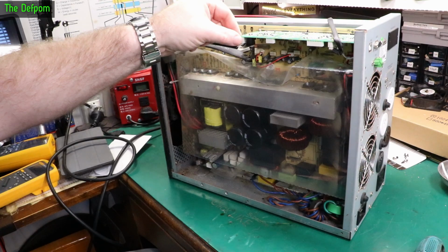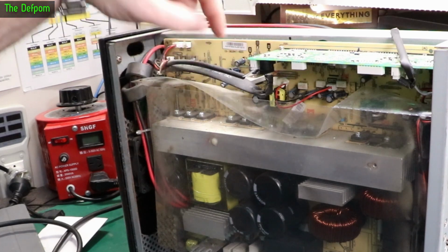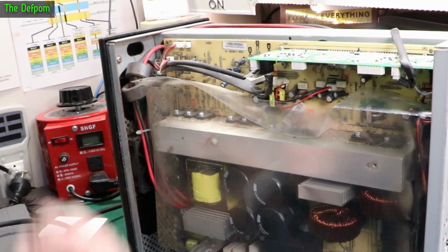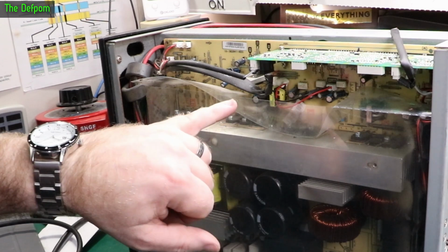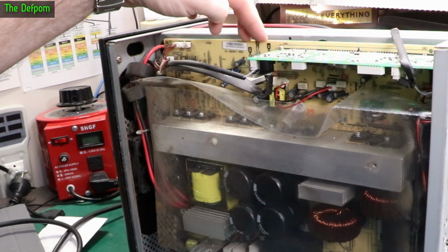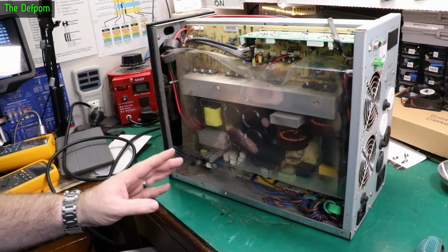This board here, these two cables, they go to the front panel. So you've got a stem one here and a flat flex. Both go down to the front panel. There should be power on this board. So there should be power available on here somewhere too. I'm still looking to see if I can see any more markings for power supplies. There's nothing really so obvious as there is here. So maybe those are the test points and that's what he uses, 12 volts and 5 volts and that's it. It's possible. But there could be other stuff around too, which I just haven't noticed yet.